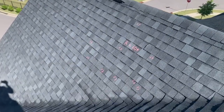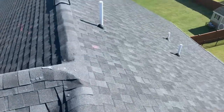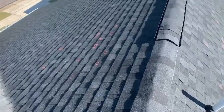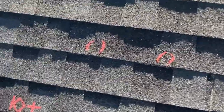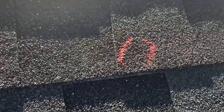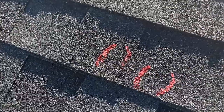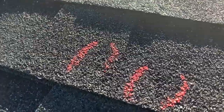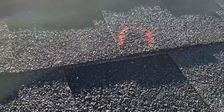We're up on this roof and we definitely found some hail damage — 10 on the right side, we found 10 on the back, we found 10 on the front. Actually way more than 10, but take a look at this. Sometimes we get the shadow — see that shadow actually creates a divot, shows the divot for us. Great way to use the shadow of the sun as it pops over the edge of the roof line to be able to see the damage that the hail created. Really hard to see in the bright sun, so that's a big plus. Hope you guys can see that divot that is created.